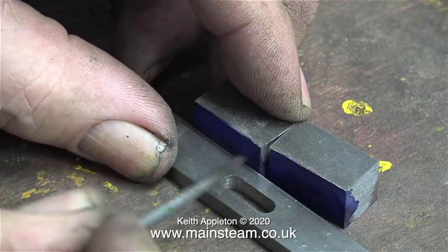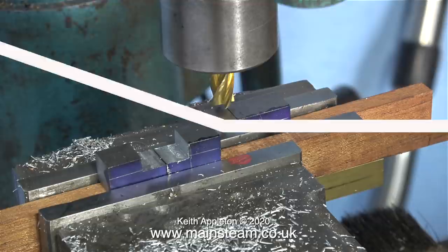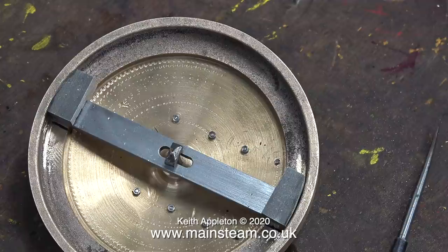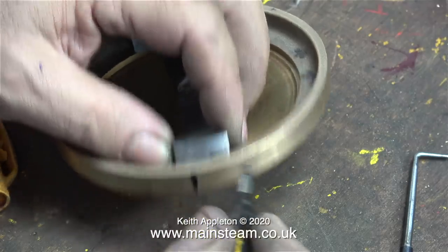There are many different ways of making these supports — I'm doing it like this. I've marked out two steel blocks, here they are in the milling machine, and here they are once I milled them to the correct shape. This clip gives you quite a good idea of what the end product is going to look like. Using my one-inch belt sander, I shaped one side of each of the blocks to fit the inside radius of the smokebox ring. I've also milled the end of the crossbar as well.